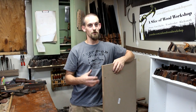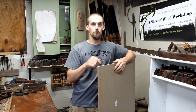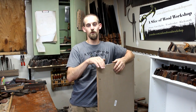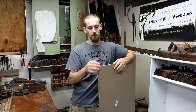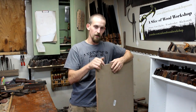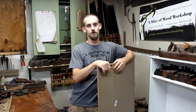Last but not least, if you're going to be building something, you have got to have the main material, which is wood. This will be the stand for the motor, and also the front where you're going to be resting the wood while it's getting sanded. Right now I'm going to be using a 1/2 inch MDF. We're going to see how well that does. Should be pretty stable for what I'm going to be doing. It's not really going to be moved around too much. It's going to be really just like a bench top model. So this should be definitely fine.